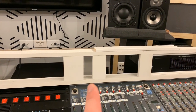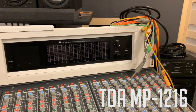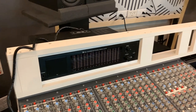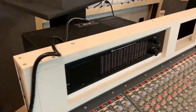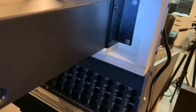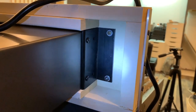We have a little void space, the tablet frequency analyzer, and then this is actually one of the 16-channel LED units — this is a TOA MP12-16 unit. I'm going to be using two of these, one on each side, and they connect to the direct outputs on the mixing console. Now I just installed the left meter and the right one was already installed — this shows you a little bit of what it's going to look like in the end. This is how I mounted it: I used a flat piece of aluminum, drilled some holes in it, mounted it to the existing hardware. The LED meter is backwards-mounted with standard 19-inch rack mount ears, just screwed through with short enough screws so they don't poke out the front.